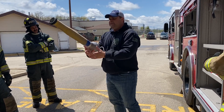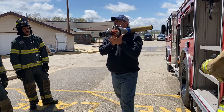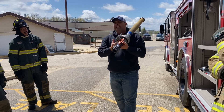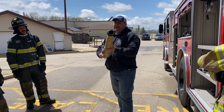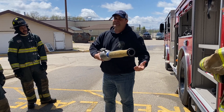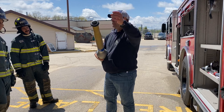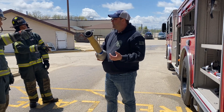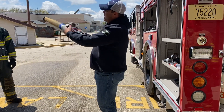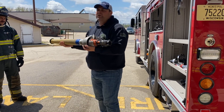So how does this work? Same idea — you've got the water coming through here. At a very high rate of speed it creates a suction effect, and all of a sudden you're introducing a ton of air into that stream. Then it mixes that air — kind of like you're making bubbles in your kitchen sink: you're adding water, you're adding agitation. Locked and loaded, and then it comes out. The foam goes from the eductor through the hose line into here, sucks in more air. You can get a foam blanket without the air aspirating nozzle; it just doesn't work as well.